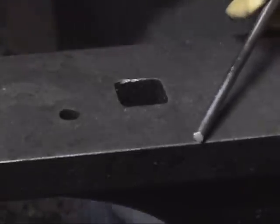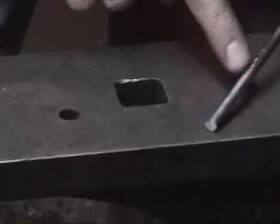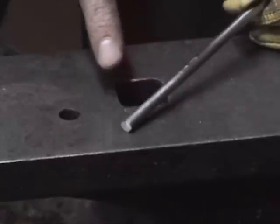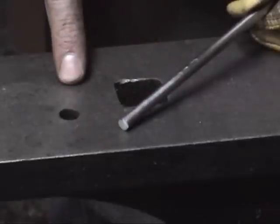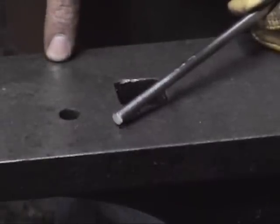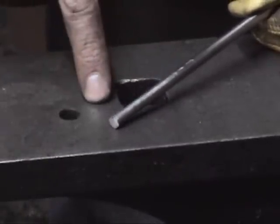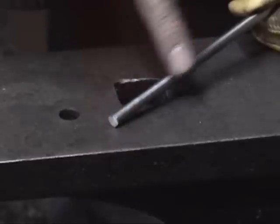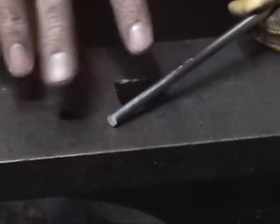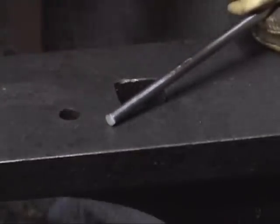Okay. So what I've done is I've taken a piece of sandpaper and cleaned up this metal so that you can see its appearance again. You need to be able to see this to do what we're about to do here, which is a kind of visual temper, the way things have been done for ages. For the O1 tool steel, to get a decent, workable tool, you want to temper back to about 400 degrees.